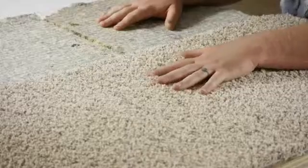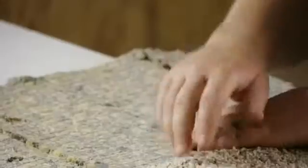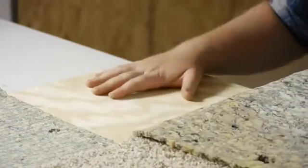Here we have a little display of what is actually underneath of your floor. So you have your carpet on top, and then they put a padding underneath that. And what they do is they staple that, usually along the seams and along the walls. That keeps it from shifting a little bit. A lot of times they'll run one strip right down the middle of about 5 or 6 staples. Then under that, you have your subfloor.